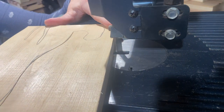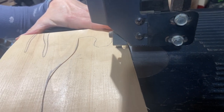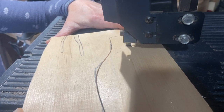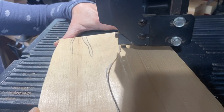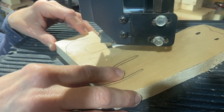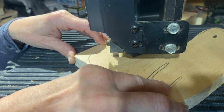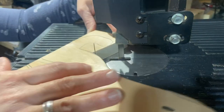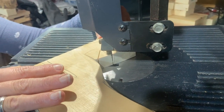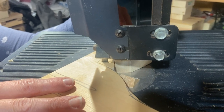My blade is not very sharp — I need a new blade or to resharpen this one so we're taking our time. However the power tool will be faster than anything else — it is plenty powerful and for the wood we're doing this is really a great tool. My blade is rather thick which means we cannot follow the contours we've designed very closely, but that is okay because we can go back and forth and change the angles to achieve contours even with a blade that's a little thicker than you want. Using the tools you already have the best possible way is what we're going to try to show you. We actually do have a scroll saw but we decided not to use it because most people do not have one, and the method we're using here can be very easily transferred to a jigsaw which is an inexpensive saw that most people have.